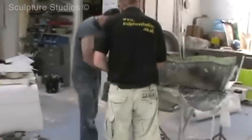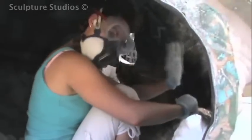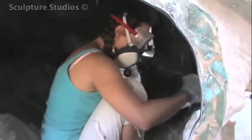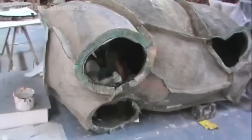As the sculpture is going to be situated out in the open and exposed to the weather and the elements, we're making this nice and strong, going on with a four-ounce build-up of glass fibre. If this were one of the sculptures being used in a public zoo or out in a theme park where it's likely to get kicked, touched, or possibly climbed on, we'd often go up to a really sturdy build-up of six ounces.